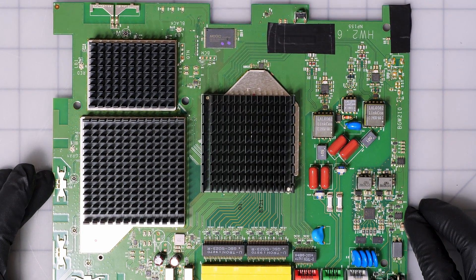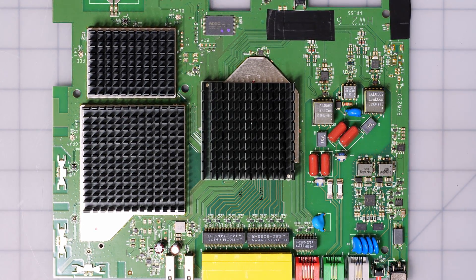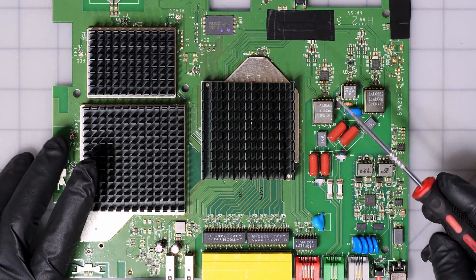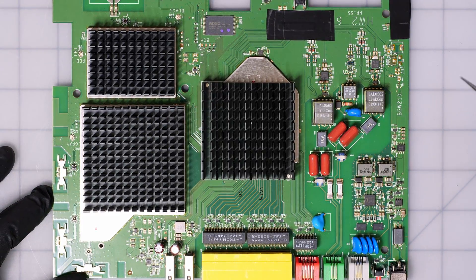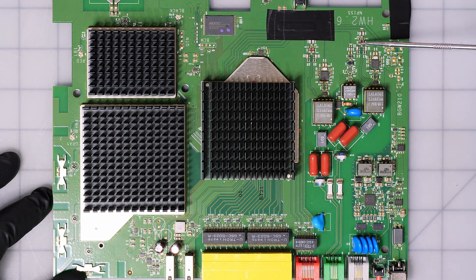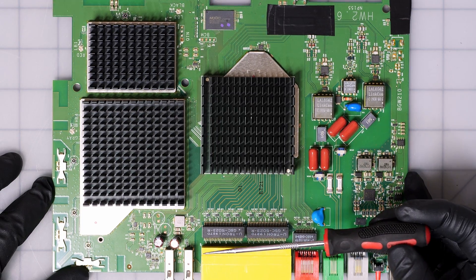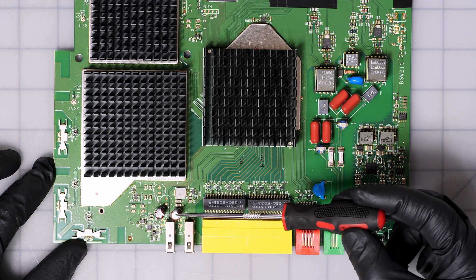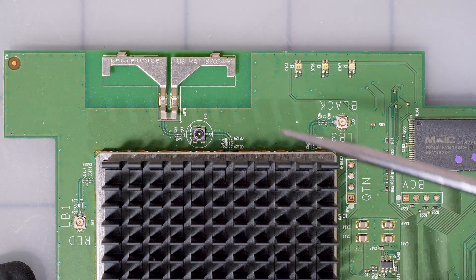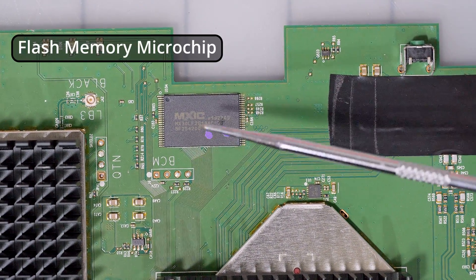In this video, we are going to be talking about circuit boards, PCBs, and most importantly, drag soldering — that's going to be the main topic of this video. When you're working on a circuit board, especially modern circuit boards like this, you will get what's called a surface mount chip. That means it'll be mounted to the surface of the circuit board instead of through-hole, which is the more traditional kind where you see the pin go through the circuit board and out the other side. So when you don't have a through-hole type of connection, it can be intimidating to solder components.